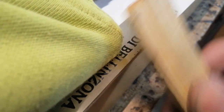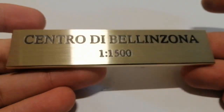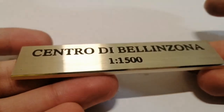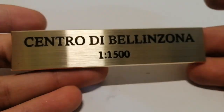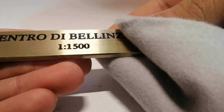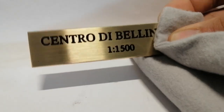The last thing you want to do is give it a coat of something transparent to keep it from oxidizing, because if you leave it like this it's going to gradually turn into a dull brown color. Also, after giving it the last sanding, you're going to want to avoid touching it with your fingers on any part that has to look nice, because any residue of fat is going to make it oxidize a lot.